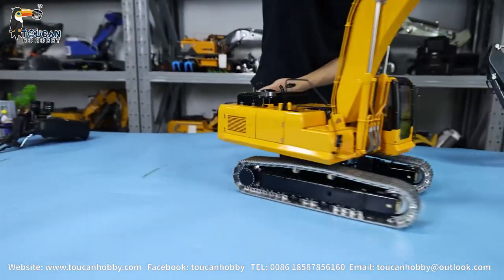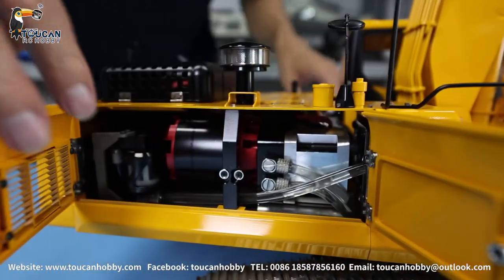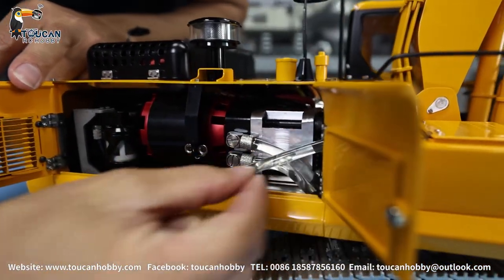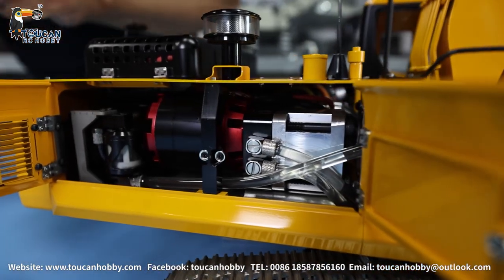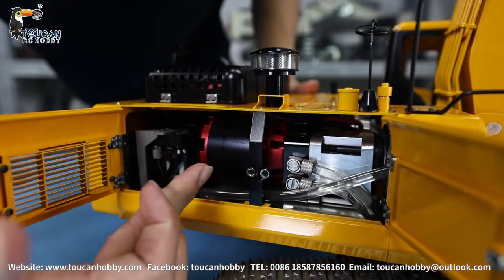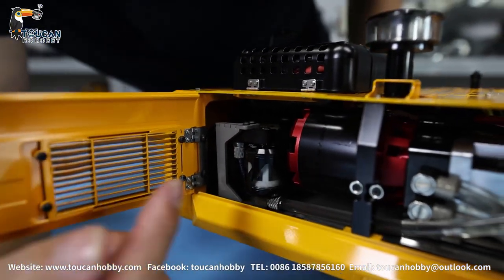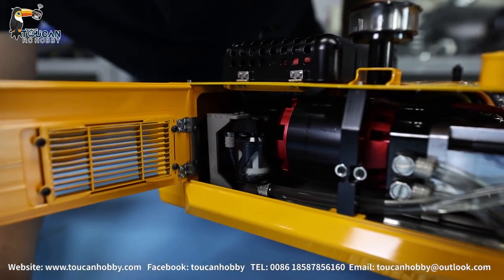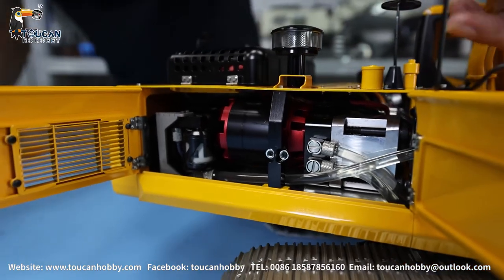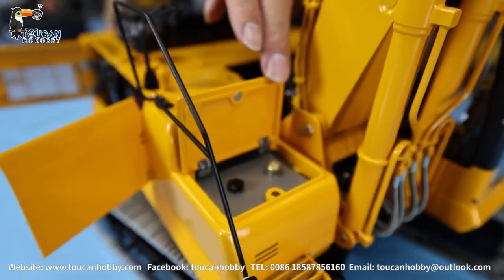From this side, you can also open the panel. As you see, the hose from this side is transparent. We are already running the pump and you can see the oil inside is clear — very clean, meaning the quality of this hydraulic system is very good. No dirty oil, no black oil. Here is the filter, and there is a magnet inside. From this side you will see the pump body, and going forward you will see the oil tank. The oil tank is in the front — you fill up the oil from here.